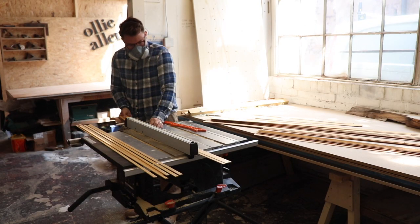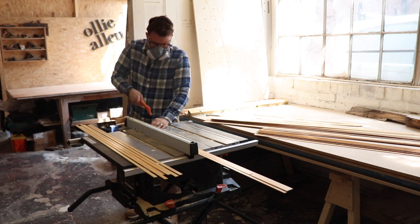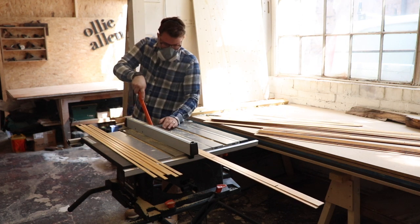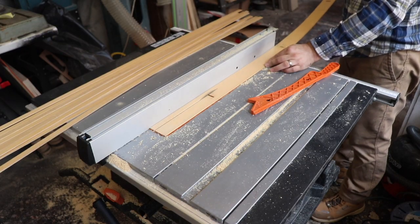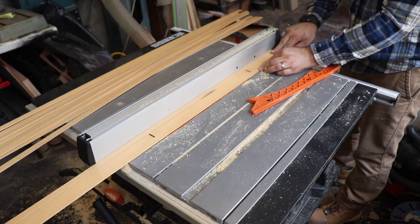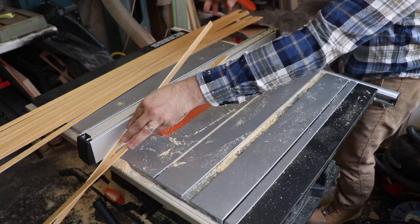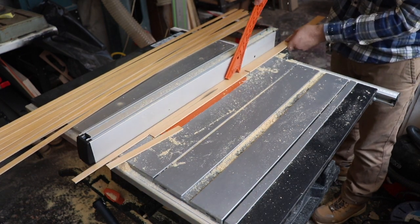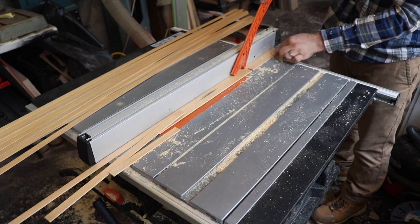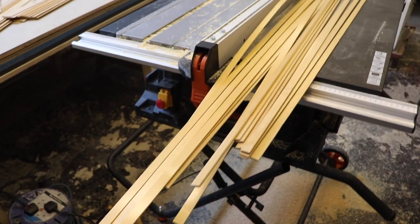Then we can put them in the steam bender and get some nice curves and loops. For a long time I've wanted to test out steam bending timber — I tried a little bit of laminating whilst I was at uni, and this is a perfect opportunity using really skinny bits of timber that would bend really nicely and easily. I built myself a DIY steam box: really simple, a couple of bits of soil pipe and an old wallpaper stripper. Here I'm just processing as much of the blind as I can get into strips to give me the most amount of material possible.